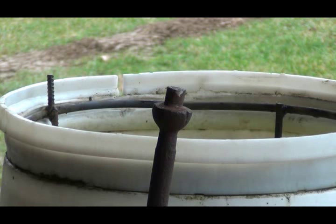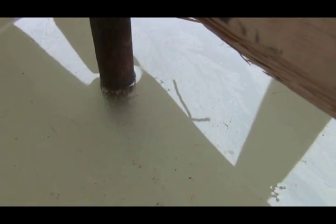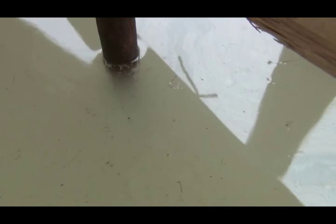The reason I'm going ahead and giving it another shot, the vise really doesn't look that much different. But with all the rust that was in the water and on those rebar, it had to have done something, because it was a rusty mess in that bucket. So we're going to give it another shot and see what happens. I just turned it on and you can see the bubbles forming on the side of the steel. Hopefully we'll get her done this time, or even noticeably better.